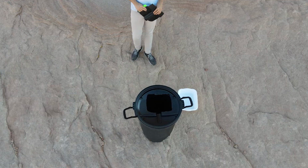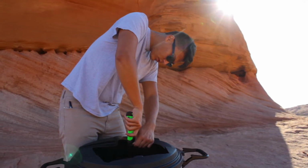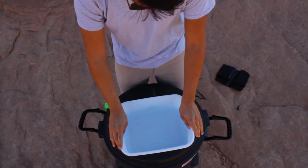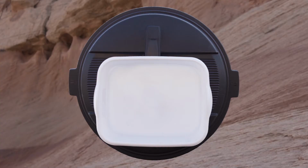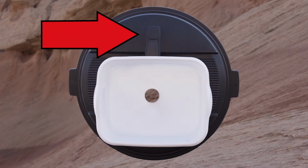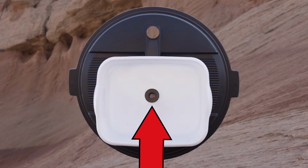Once you're finished, flip the lid right side up and make any adjustments as needed until the container fits snugly into the lid. Nice job. Next, we will be cutting two holes. One inside the sink to provide draining, and the second 3 to 4 inches above where the sink now sits. The upper hole will be used for the plumbing and faucet. We will be placing our plastic half-inch bulkheads into both the holes.